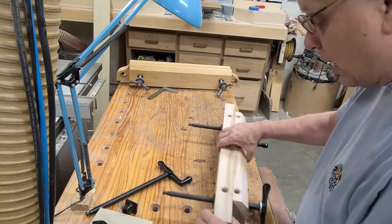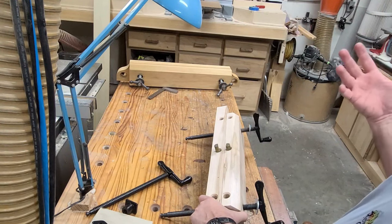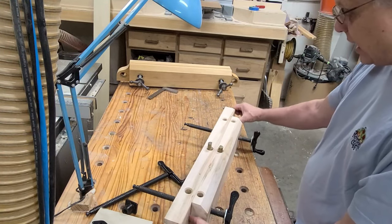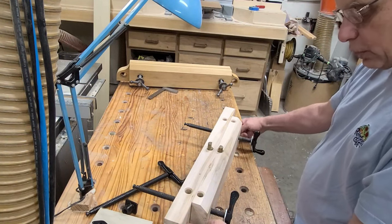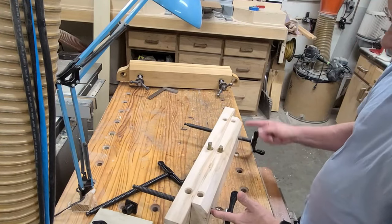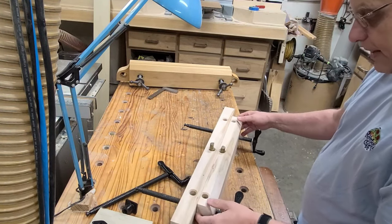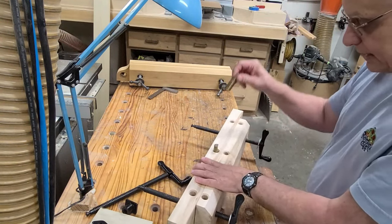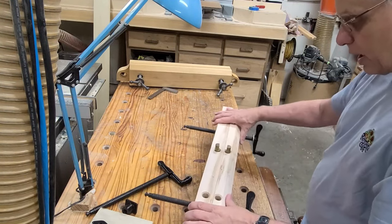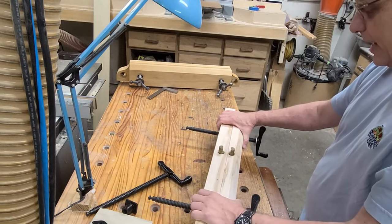Once the coupling is set in the back jaw, all you need to do is drill an eleven-sixteenths inch hole in the front jaw, and the vise is basically done. For layout, I leave three inches on each end for the tab to attach clamps, make the jaw the distance between those tabs, and come in two inches from each end of the jaw to drill my holes. I also put a couple of holes in the top to accept bench dogs, and added a small bevel so my saw won't hit the corner when sawing half-blind dovetails. The whole build from rough lumber to finish took about 45 minutes.